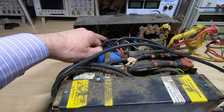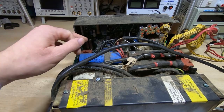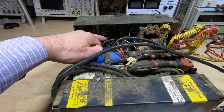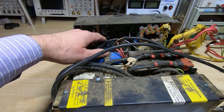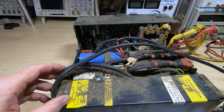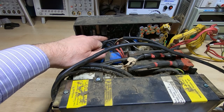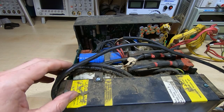The difference is that the hybrid modules IBM developed were ceramic bases with discrete elements put onto them — transistors, resistors, that sort of thing — whereas monolithic ICs have the entire circuit on a single chip. These aren't like that; there are multiple chips in here. Quite what's in this particular machine I'm not sure, as this was built quite a long time after IBM developed these. They may be standard SLTs or these might just be carriers holding monolithic ICs. I'll be going into these in detail in a separate video.